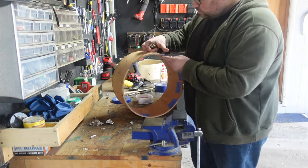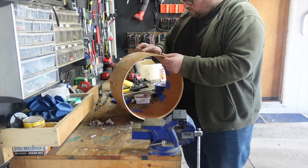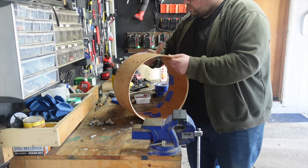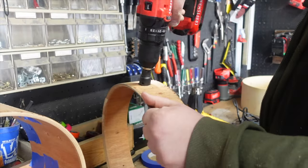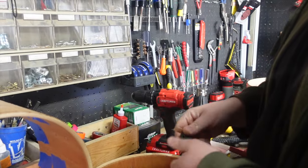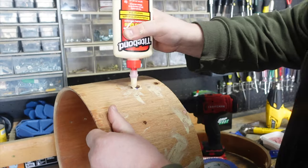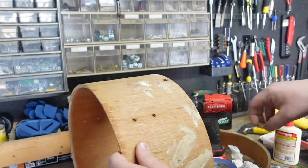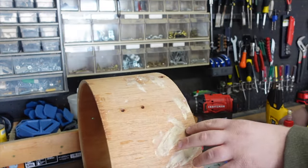After getting them cut down, I was able to begin filling any extra holes on the shell with wood filler and plugs. On the 14-inch shell, I had a larger hole from where the tom mount was, and I ended up cutting a plug for this with the hole saw on the leftover scrap from the cutoff. This is a great option because you can be sure that the plug you cut will be the right profile and thickness to fit perfectly in the shell.